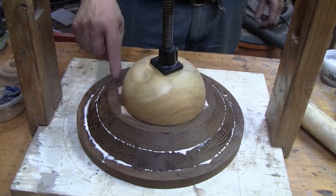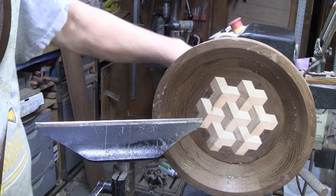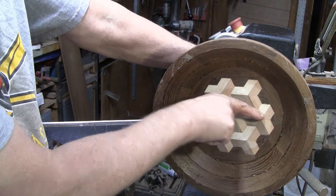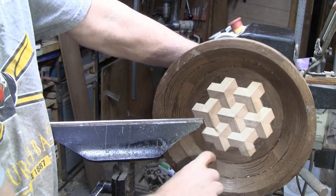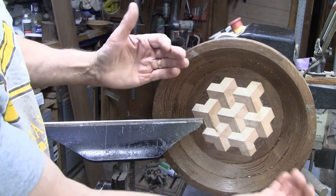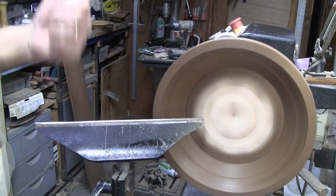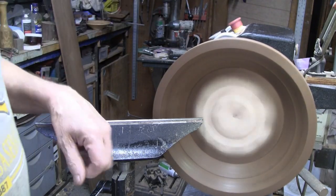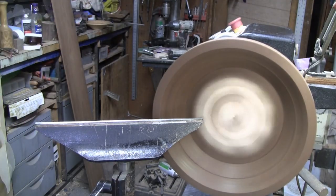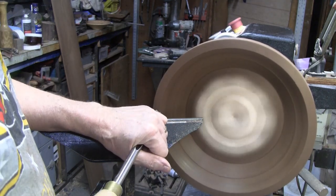Tomorrow we'll get this up in the lathe. I have it back in the chuck — that's all night plus part of the morning. I'm just going to clean this up; there's not a lot of shape I can do in this short distance. Both rings were cut out at 45 degrees. I just want to open this up so we can see the illusion. I'm turning at about 850 RPM and it's running quite true. I'm pretty happy with how that glue-up went — half-inch bowl gouge, just cleaning it up.